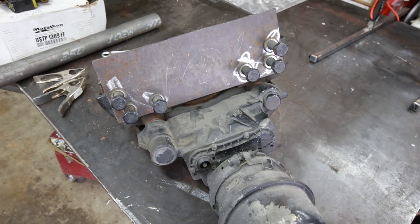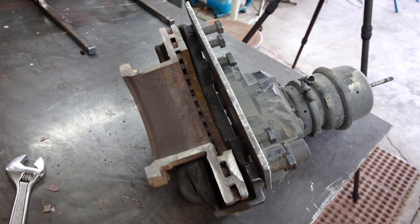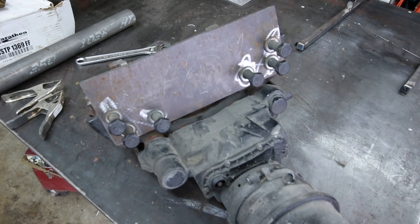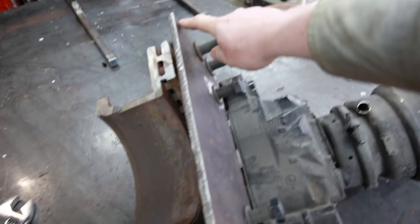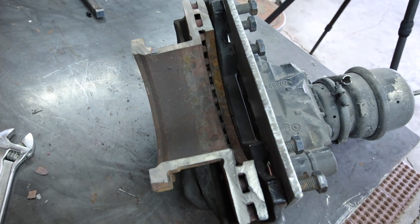I got my mounting plate burned out here, got my holes burned in it, and got my brake rotor cut in half. I think what I'm going to do is go ahead and find the centerline of this guy here, stick my mounting tube on there. First I got to drill a hole here in my mount tube so it can go in that engine stand. I may go ahead and radius the corners on this just to kind of clean it up a bit, make it look a little nicer. And then I got to figure out a shelf or something for this brake rotor to sit on there.